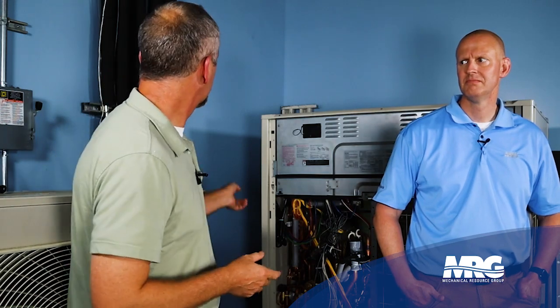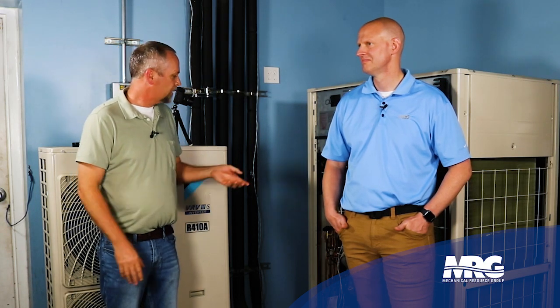After that's been done, the next step is to use that vacuum to pull in as much of the calculated refrigerant charge from our liquid line measurement as possible. In the field, we have the contractor provide those measurements and then we do the calculation ourselves. Daikin has service apps that will do the calculation for you. We want to use the vacuum on the line set to pull in as much of that additional charge as we can.